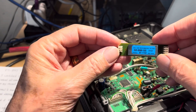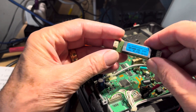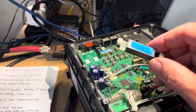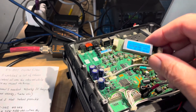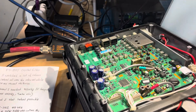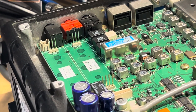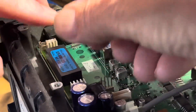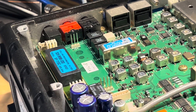This is actually the correct one. It has three holes or pins on one end and four on the other. It is 51 millimeters between the pins, and the board itself is 56 by 15 millimeters. There are three pins in the back and four pins in the front. We put the three pins on the three-pin socket and the four pins on the four-pin socket — that's all there is to installing a crystal filter.